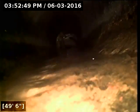And that appears to be pretty much right here at this transition. You can see how hard that water is gushing down from the top of the line. So that's going to be another issue. I just figured that was water still running, but whatever is leaking is just pouring water through here. So I would definitely get the city involved in this one.